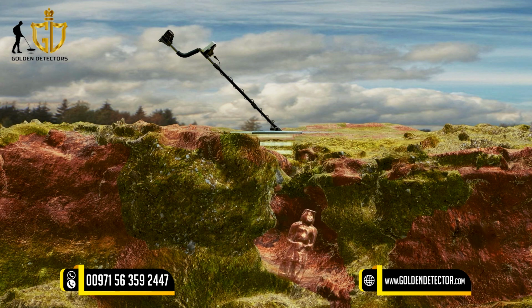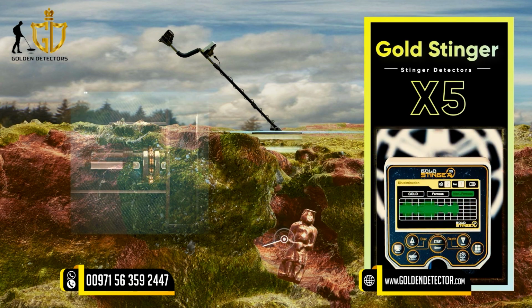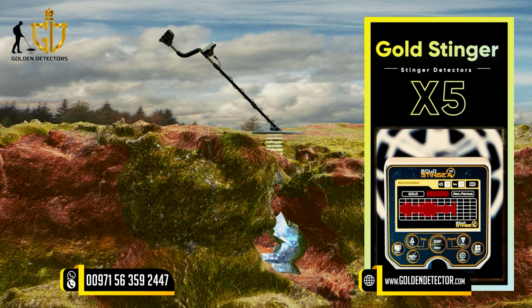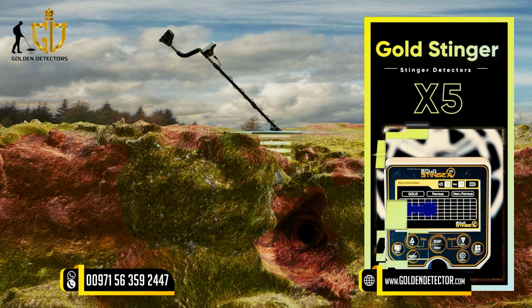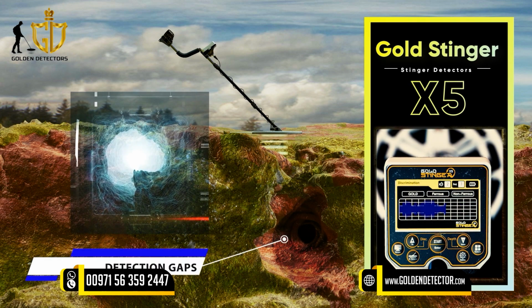And when it detects ferrous/non-ferrous metals, in the case of detection of non-ferrous metals, the device will make another distinctive sound and show a green color graph accompanying the sound. In the case of detection of ferrous metals, the device will also make a distinctive sound and show a red color graph accompanying the sound, as shown in the video. In the case of detection of gaps, the device will display a blue graph without making any sound.